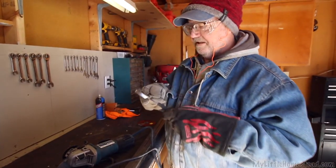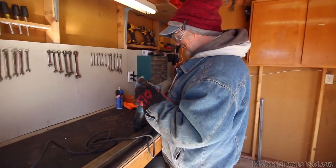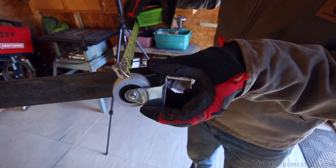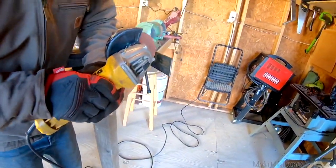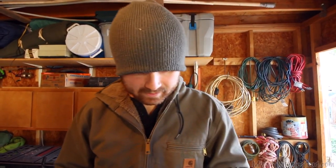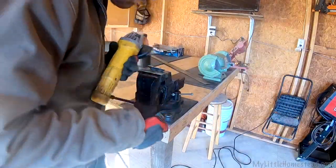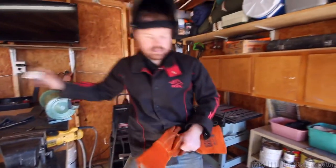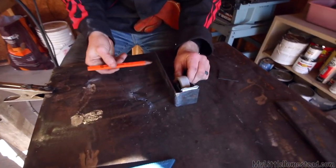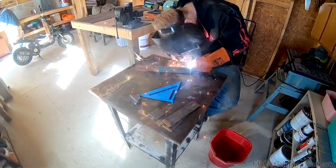That was a lot of cutting, but it looks good now. By the way, you don't recognize this tool because it did not come out of your bucket. For the door rollers we're going to use some two-inch flat stock, welding it into an L-shape with a caster on the small part of the L and the door hanging off the large part. I'm working on welding up all the pieces — little L's with little triangles on them. The wheels weld on here, I'll drill a couple holes, and the door will bolt right underneath. The track goes in between the door and the wheel.